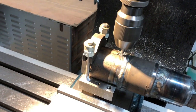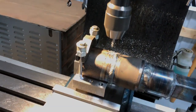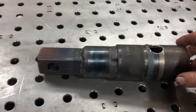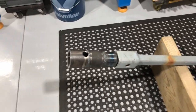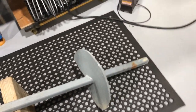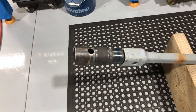Got the square stock welded to the socket, and then to reinforce strength I made a collar that slips over top of the seam — it's going to get welded here and up in here. Center drilling for the lower pin with the motor pin. That's it for this thing, I just got to clean it up and bevel that hole a little bit and she is done. There you have it — hex to square adapter for a helical piling. The motor that drives this actually has a torquemeter and it's up to the operator whether to continue twisting or let off. We've got to drop about 100 of these in the ground, so if this thing twists in half I'll bring back two pieces and do a video on it.